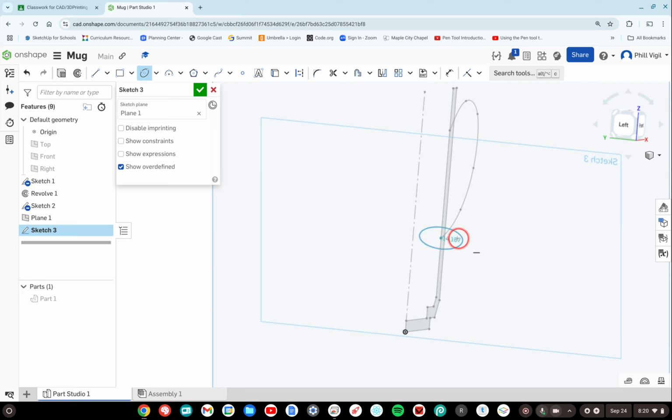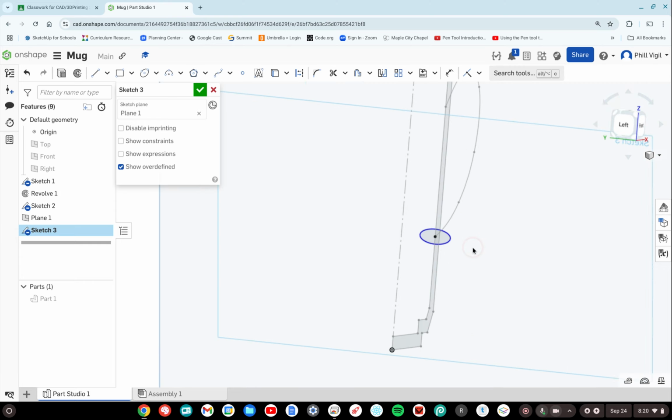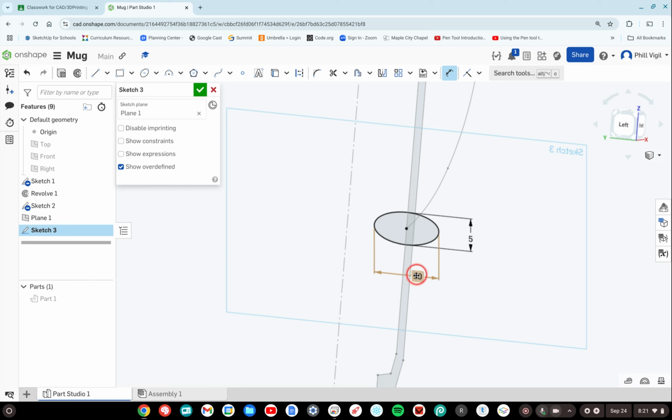And this is created by first determining one length, so the wide point here in this instance. So I click there, and then the height of the short side in this scenario. And then I click, and I can always go in and change the values. So I'm going to dimension it so I have the option to change it later. So I can click and place a measurement for the short side, enter, and then click again on the long side, and then press enter. So these are my two current measurements. I want to make this nice and easy to remember by making them 5 by 10. And you can choose whatever measurements you'd like.